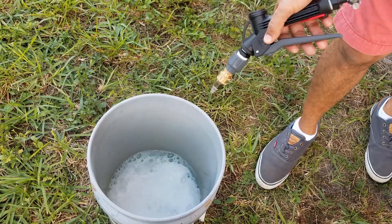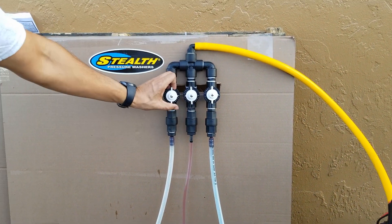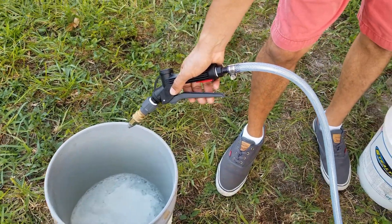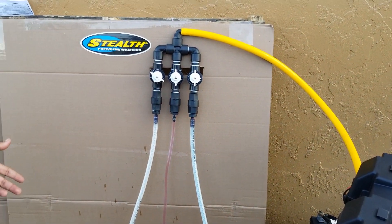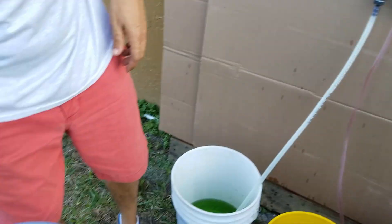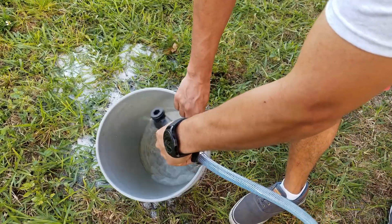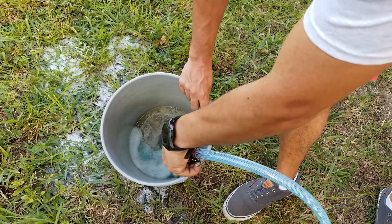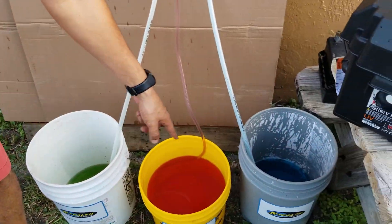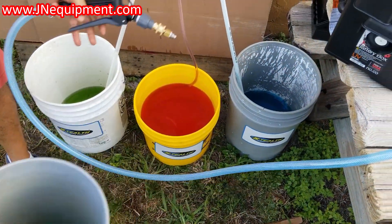As I'm working my job, if I'm noticing I'm a little too hot or not hot enough, I can just mix it on the fly — turn down my surfactant, turn down my bleach, and keep spraying. All these mixes are pretty much done on the fly. Once I'm ready to go into rinse mode, I can just turn these completely off. Now you can see I'm only getting blue water — no more green, because that was my bleach, red was my soap, blue was just clean water. I'm back to shooting clean water that quickly and that easily.